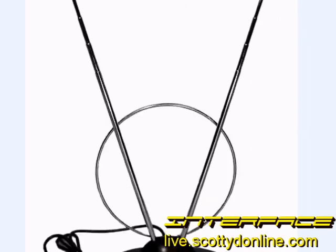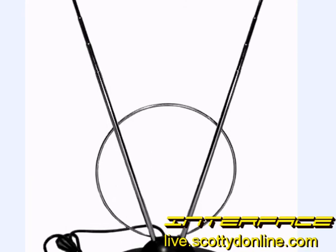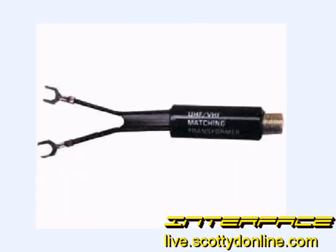You can set up an outdoor FM antenna if you like, but that tends to be rather complicated, and in most areas a good set of rabbit ears is all you're going to need. Getting your rabbit ears connected may involve getting some adapters. If the back of your receiver has a 75-ohm F connector input and your rabbit ears have twin-lead 300-ohm wires, you'll need an adapter. If your antenna has a 75-ohm coaxial lead with an F connector and your receiver has a 300-ohm input, you'll need an adapter to make sure they hook together properly.